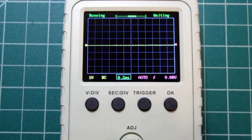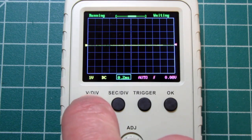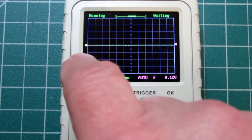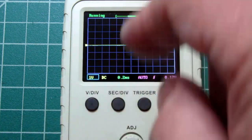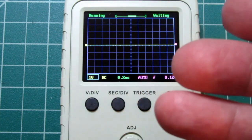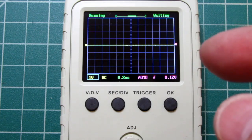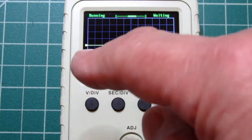Everything else is here on the front panel. I'm going to start by centering the vertical input, and that should be done by holding the volts per division button down for a couple seconds, and it'll say 'readjusting the vertical position.' You'll see there's a pointer on the left-hand side of the screen that indicates where the scope thinks zero volts is. Regardless of the vertical positioning, it always shows you where the zero volt point is in the signal, and that's based on the data stored in the so-called capture buffer, which is where all the sample data comes in and is stored for display purposes. So the zero volt point may not always be centered, and that's why that little arrow is there.